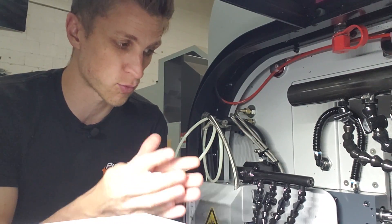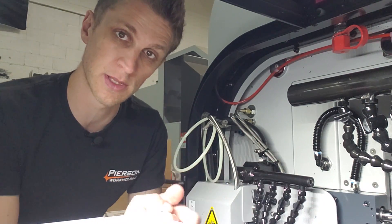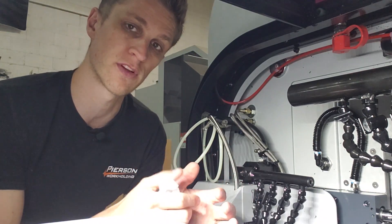For the Z you basically have a reference tool like the first one, which will be the part-off tool, and then every tool is referenced off of that Z plane. So you have to be pretty logical with how you do all of this.